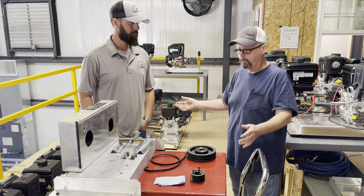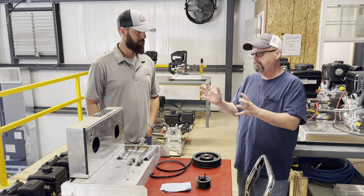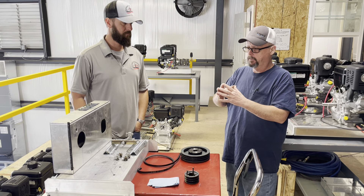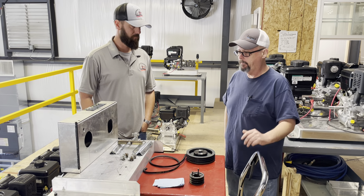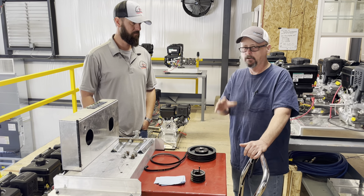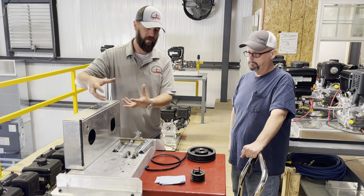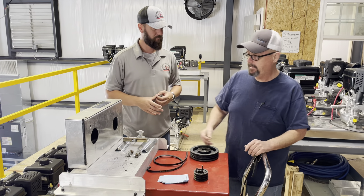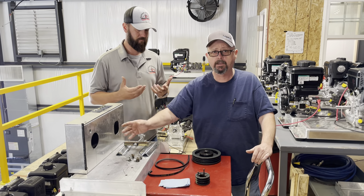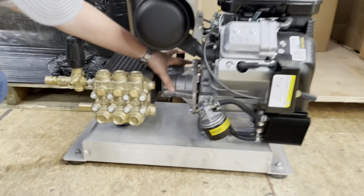There's a stroke difference between your four-gallon and larger gallon-per-minute pumps. Belt drives offer some benefits in longevity — heat and vibration transfer does come into play long term. That said, you're probably not going to see a difference in lifespan between belt and gearbox if you maintain them properly — it's kind of a fifty-fifty thing. With a belt you're not directly mating two metal parts together, so there's less heat transfer to the pump and a little dampening. What I like about a gear drive is the ease of access to check your oil — it's got a sight glass; if it's halfway full, you're good.